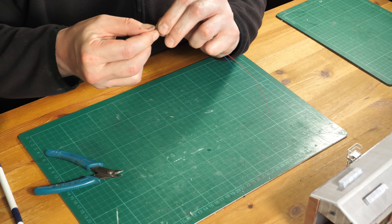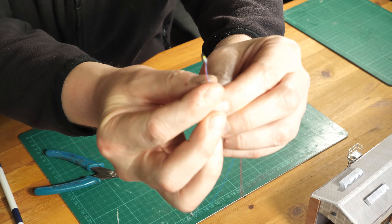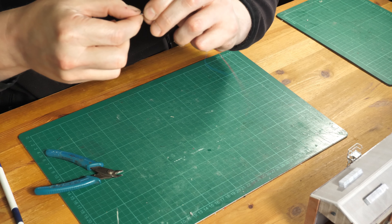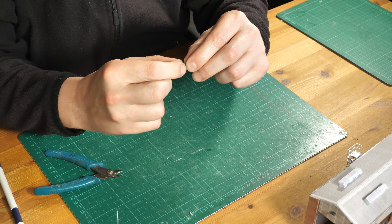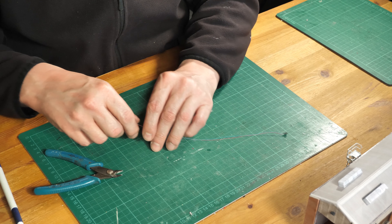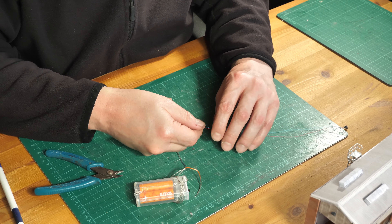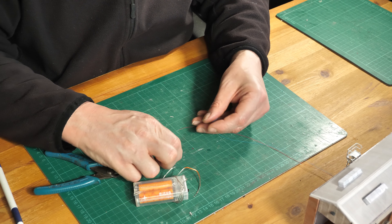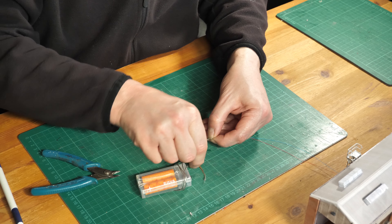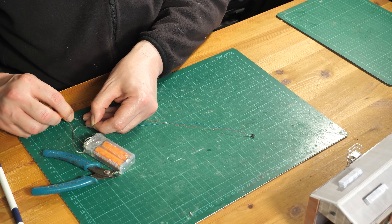You're left with a very small spotlight. You just need to drill a small hole — around about two and a half millimetres — and it'll sit nicely in that. The best thing to always do before fitting is use some sort of three volt battery, or a 1k resistor with a nine volt battery, as you don't want to blow the LED. Always give them a test first.